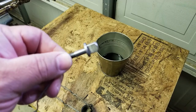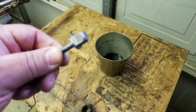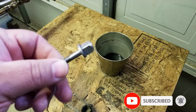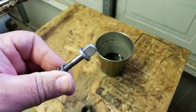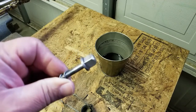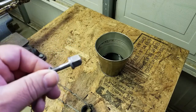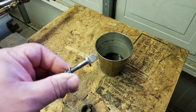So I decided to make a square-headed bolt so I can use the same wrench I'm using for some of the other lathe tools. Because this bolt is taller than the hex head bolt, I can actually leave the wrench on the bolt and it wouldn't fall off and it wouldn't get in the way. What I'm doing today is I want to blacken this bolt.